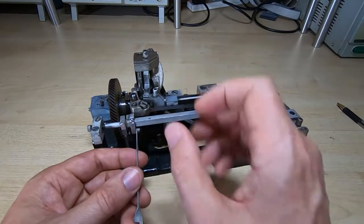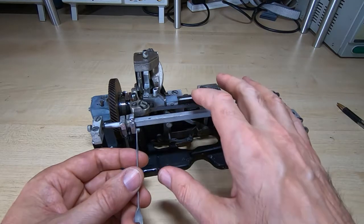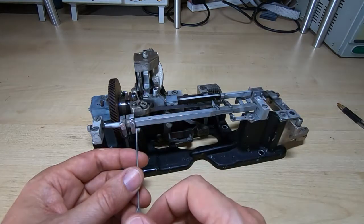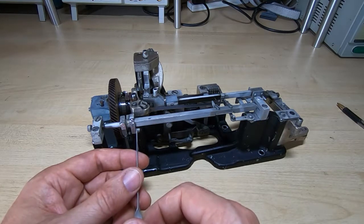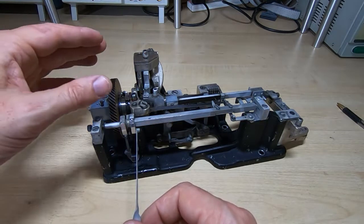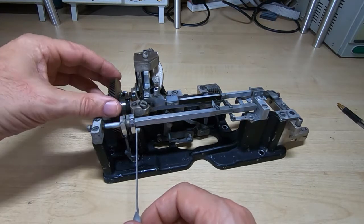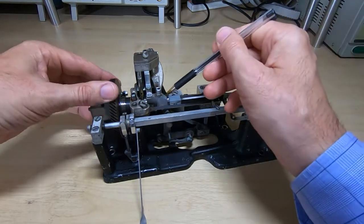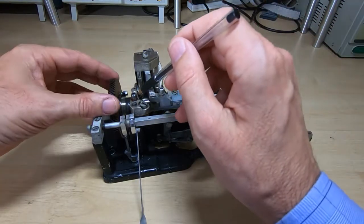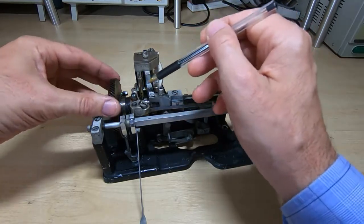This unit provides quite a few more control elements rather than just this, so we'll ignore the others for now and I'll explain those in future videos when we look at the units they control. This gear is constantly driven by the main motor, and as it turns it drives this camshaft around. There are slots in this camshaft that determine when certain functions happen — so it times everything.